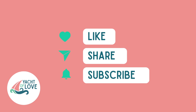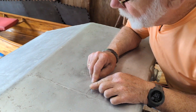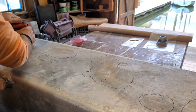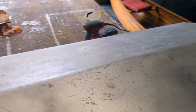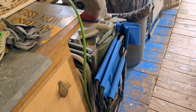Dad got the whole surface sanded down. He used 120 grit and then went to 220. The 220 sandpaper just cleaned up the top so you can see what we're working with. Then we found our problem spots, brushed them out, and wire brushed them out.